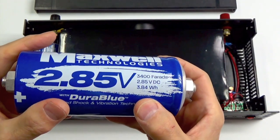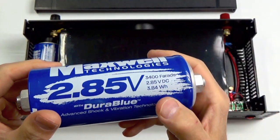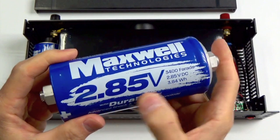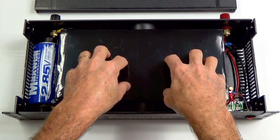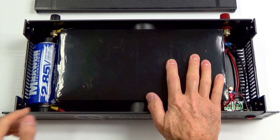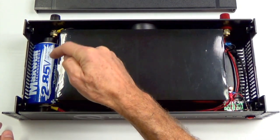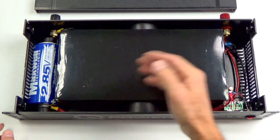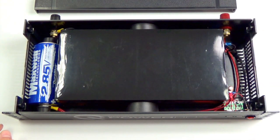It says here that it's 3.84 watt hours — it's actually closer to 4. I usually like to hold this size up to about 2.9, maybe even 2.95 volts. 3 volts is the maximum. This is a long-term electrochemical device, and its entire function and job in life is just to keep that cap charged. Naturally, it's not going to keep up with as fast as you could drain this thing — you could drain it in a few seconds if you desired, but you'd have to change the fuse. I've only got a fuse for 20 amps, and I did that for safety's sake.